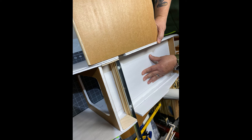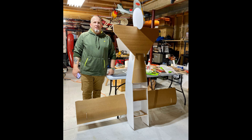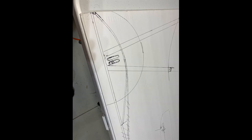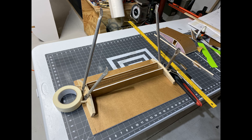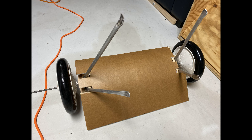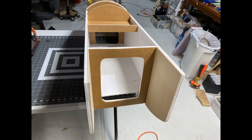A couple more pictures standing next to it for scale — you can see it's starting to become pretty massive. There's my buddy Doug again. Starting to work on landing gear sketches for size. I made these out of wood, similar to the original — which was actually metal — with a slot where the axle can ride up and down, held by bungees. The dowel rods in there hold the bungees. I also used some aluminum aerodynamic tubing for lift struts.